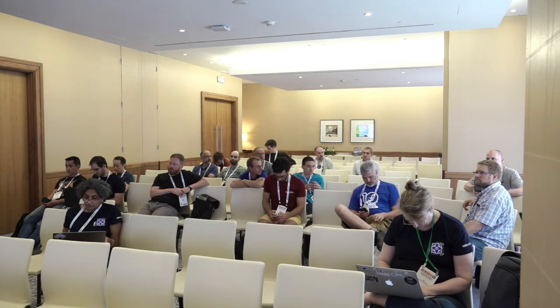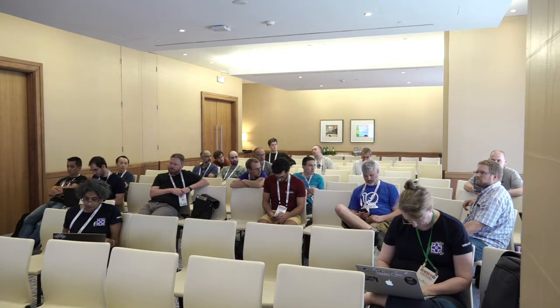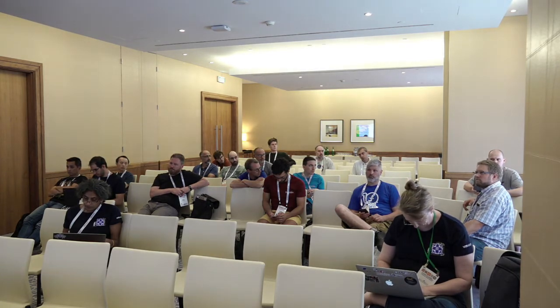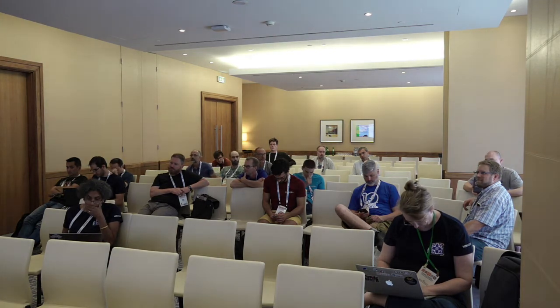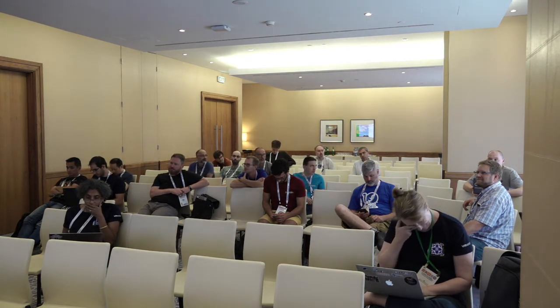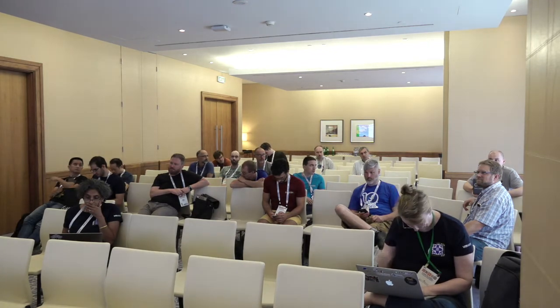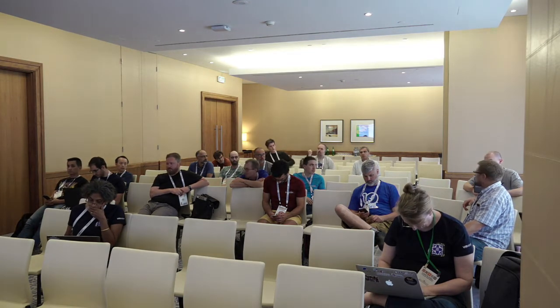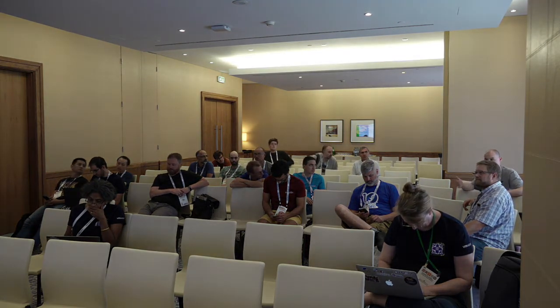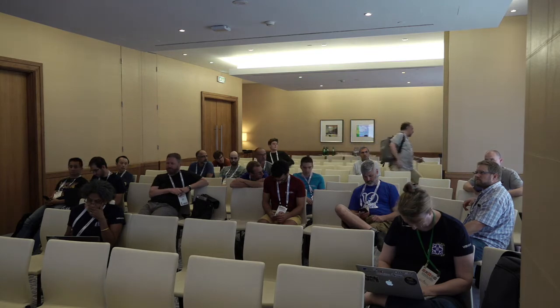And for example, for the hard and soft MAC, normally I would go with the soft MAC if you have that, but I have yet to see devices that actually have both of them. Do you have any examples for that? Yes. Okay, good. In that case, maybe you want to run that in hard MAC mode, and if you find that they are not behaving well enough, then you can switch to soft MAC. I wouldn't do that on the driver level, just during development, find out if it's hard or soft MAC. So that's what I would do at least.